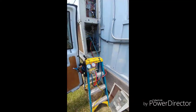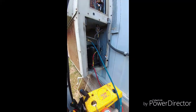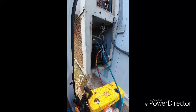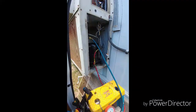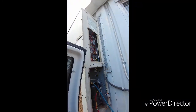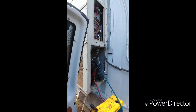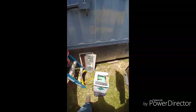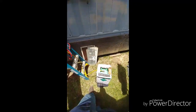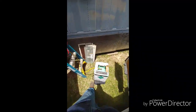The unit is on, you can hear the compressor. I went inside — there's really cold air coming out already. It's gonna get even better as soon as the room starts cooling down, because right now the room is still hot. I checked the nameplate to see how much Freon this unit takes — it's 68 ounces, which is about four pounds, a little bit more than four pounds of R-22. I used my weight scale — that's the best way to do it when you have an empty unit. Go by the nameplate and don't base yourself on pressures; just put whatever the nameplate says and you won't have any problem.